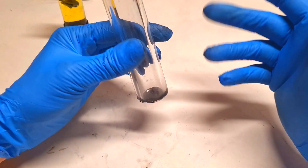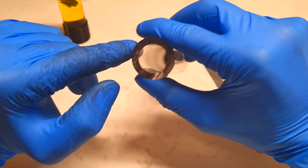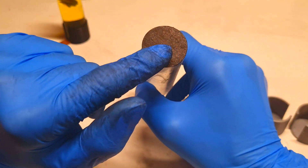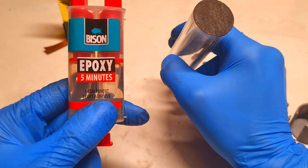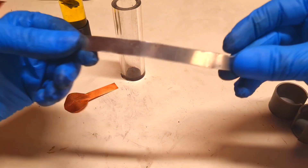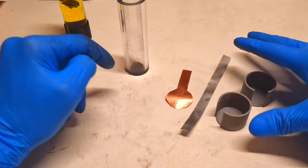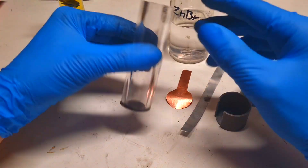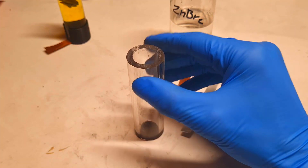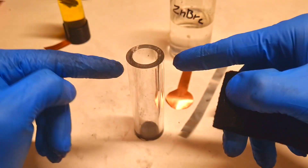For this reason I will make a new cell. Here I have a housing made from acrylic pipe, on which I already glued some conductive HDPE with epoxy glue. I also have a copper current collector, some zinc for the negative electrode, holders for these two electrodes, and the zinc bromine electrolyte. I will also put some conductive material — in this case activated carbon felt — which will increase the performance of the battery really nicely. But activated carbon felt is a little bit harder to get, so instead I will use something else.